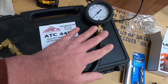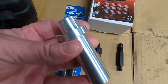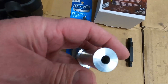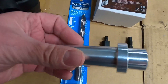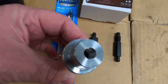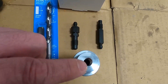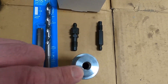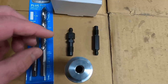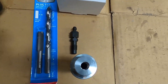So this is what I have for the compression test. I've got the use of a friend's tool — a compression tester for diesel. What I found online from a Tractor Supply store was this aluminum adapter, approximately one inch diameter at the bottom, that will slide in where the injector is on the engine. On the top it's threaded with a hole through it, but it comes with a one-eighth NPT thread, which is too big to use with the M10 adapter I had available.